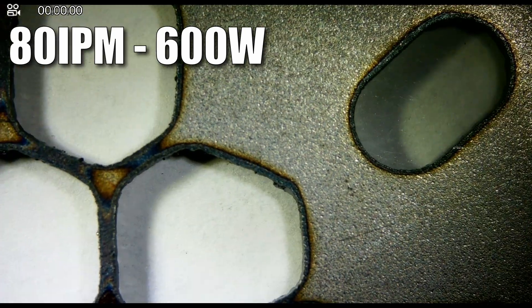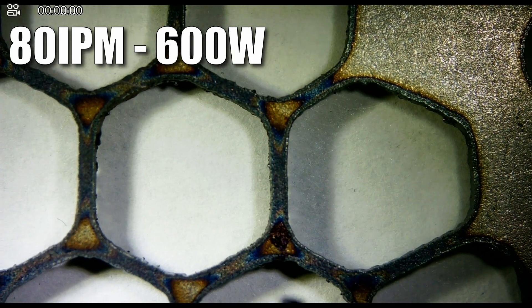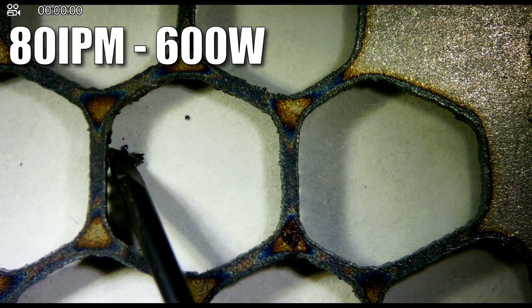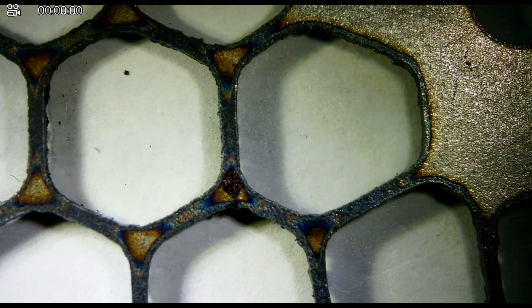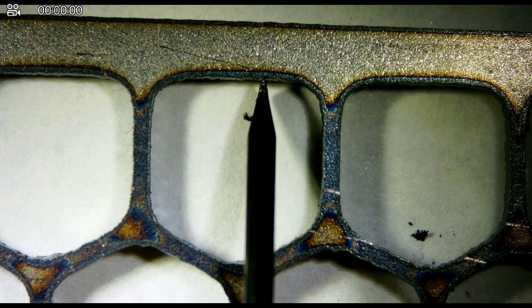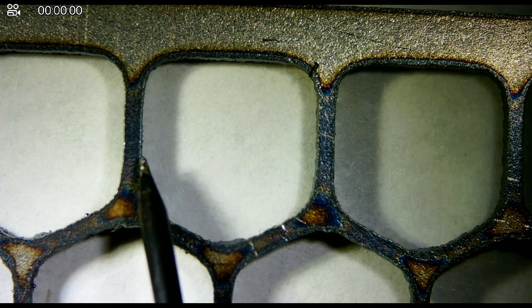Now this is the 80 inches per minute piece. Here's our slot, we skip over this hole and we're looking at these three bridges. What I want you to see is that we're down to really minimal ringing throughout these entire cuts. Let's go up and look at the top row — you can kind of see there's just maybe a very slight little bit of ringing when it comes around the corners. This is actually kind of exceptional cut quality.